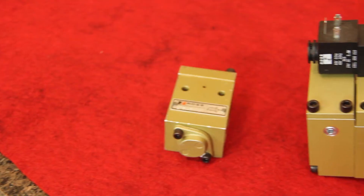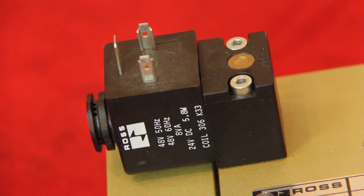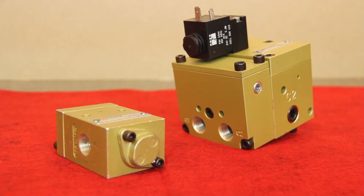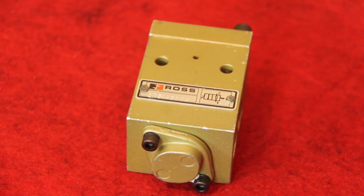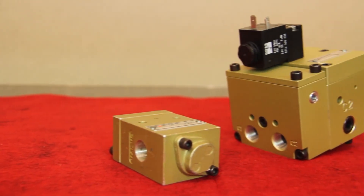Vertical cylinder applications must consider the loss of air pressure and what happens to the safety function. A pilot operated check valve is designed to trap that pressure and hold a load in place. The design provides a positive force using the force of the trapped pressure to help hold the internal poppet seats in place, to ensure that a good seal is made.